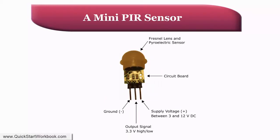It's very easy to get the positive and negative pins mixed up. If you do connect the positive and negative pins the wrong way around in your circuit, the sensor should hopefully be okay, but the circuit won't work. Check what supply voltage is required for your sensor and choose an appropriately sized battery.